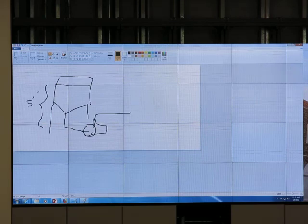It's not going to pump. Why is that? Because if I have less height, let's say instead of 5 feet I have just 3 feet, it's not okay because I deliver less than I try to pump out. I pump it out very fast, but the input is coming in too slowly. I try to pump out faster than what is coming in. What do you think happens? Cavitation, right? Air bubbles. It doesn't mean it's boiling, but there's a phase change. We try to break it or something. So the amount coming in has to match the amount going out. If my pump has a lot of flow rate, this means there has to be a lot of pressure coming in too. Otherwise, I pump out more than what is coming in.